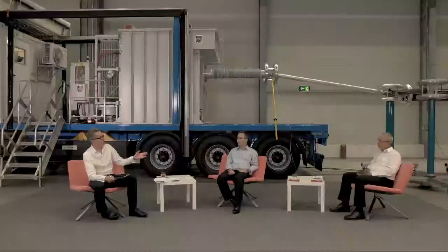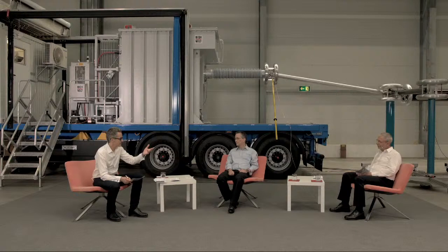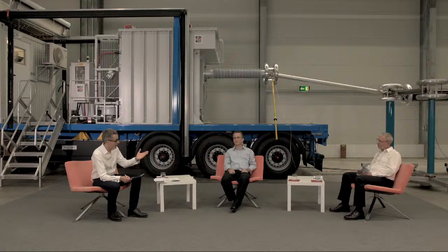To Peter Kors — thanks for the video. The commissioning test of extruded cable systems with AC voltage near power frequency best reflects the later stress during operation. Combined with sensitive partial discharge measurement, it can reveal weak points in the insulation. In which way will these challenges mentioned by colleagues and the cable design influence the test circuit?